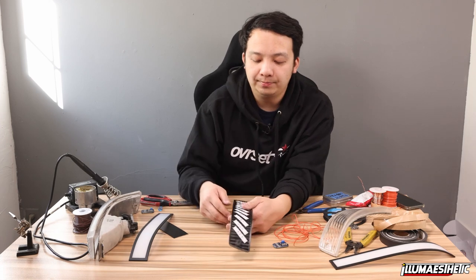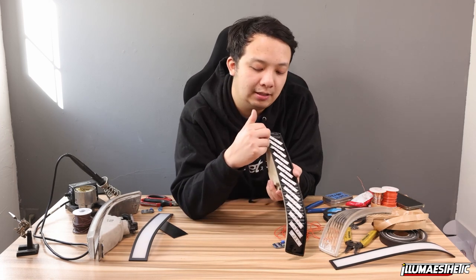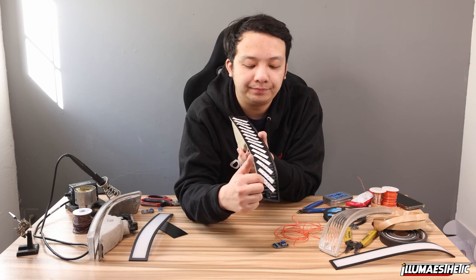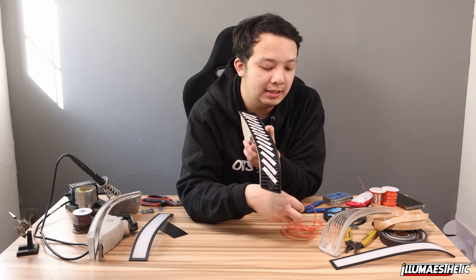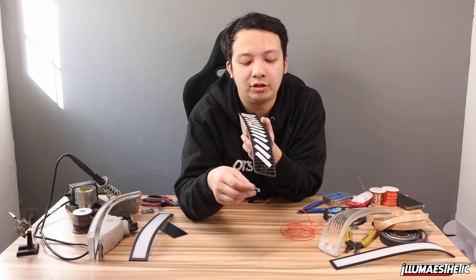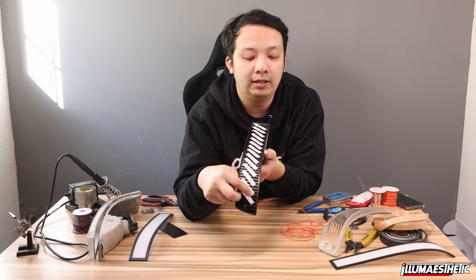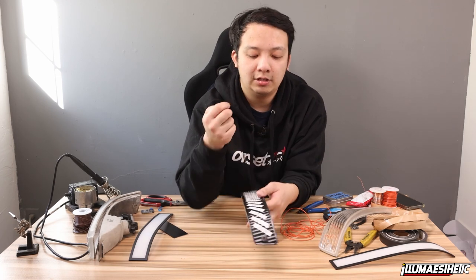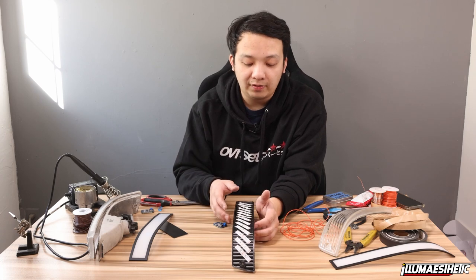So now what I'm gonna do is I'm actually going to universally connect the entire ground area here with one copper wire, because this is the ZLEDs module, which is power switched. And then I'm gonna connect the 12 volts with each other individually so that I can hook them up to the sequential module. So I'm gonna go ahead and do that. And I'll show you a quick example, and then I'm gonna go ahead and finish the rest.